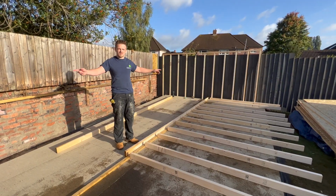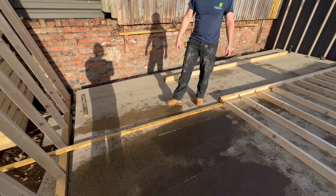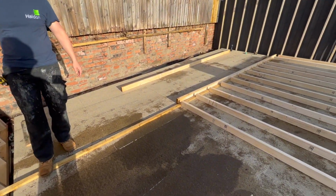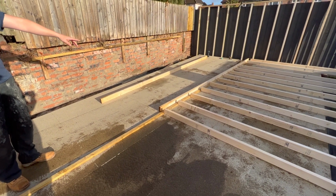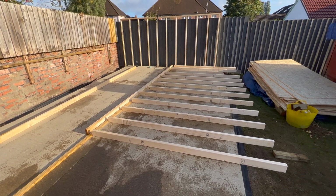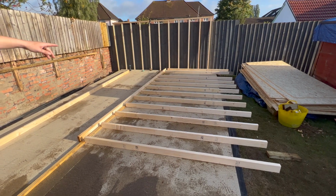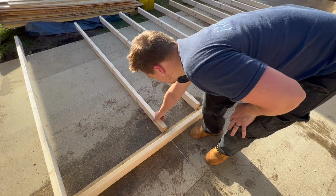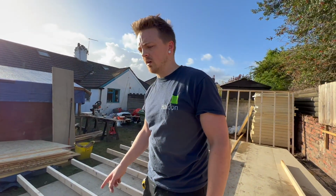For the same as what I did for the side walls, to get my length of the uprights, I've done the same again. I strung a line from here right down to the end, deducted the 78 mil for the top sole plate. I've done the whole length of the shed now for the back wall. Funnily enough, there's only like 20 mil difference in the whole length, so it's not too bad. I've marked out all my centres now, my 400 centres. Got my timbers up to this, nice and tight. Mark them underneath on the end, and then cut them on the chop saw,